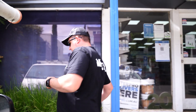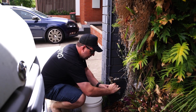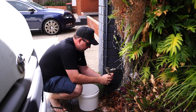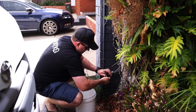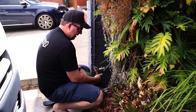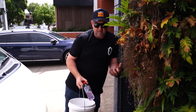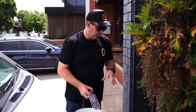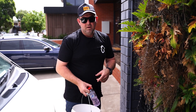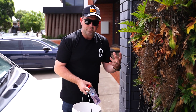The next thing you would test if that wasn't the solution would be to go to an automatic solenoid valve. In this situation, the loss of flow through that tap timer wasn't taken into account, and I think we might need to change the timer over for the client. As a company, we give advice — people come here because they trust us. This test has confirmed what I was thinking, so I'll be able to go back to the client and say, maybe we can give you a Hunter Bluetooth tap timer for free to help solve the problem, or even upgrade to a full automatic system.